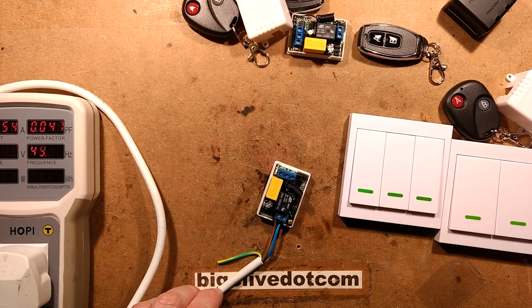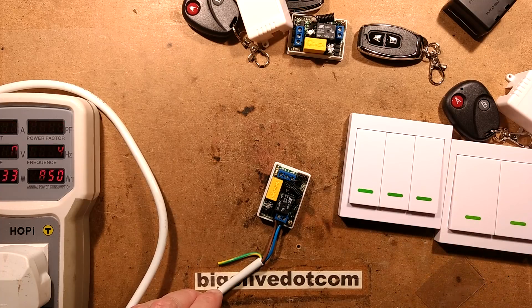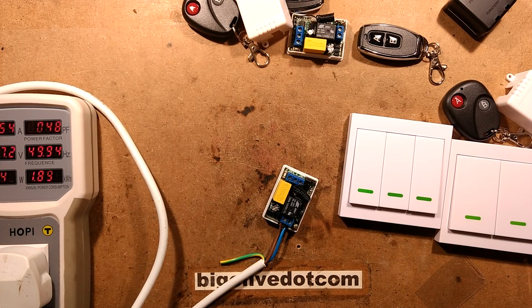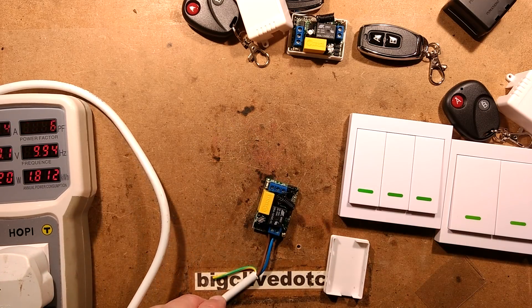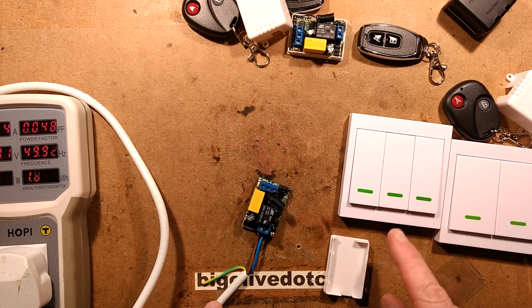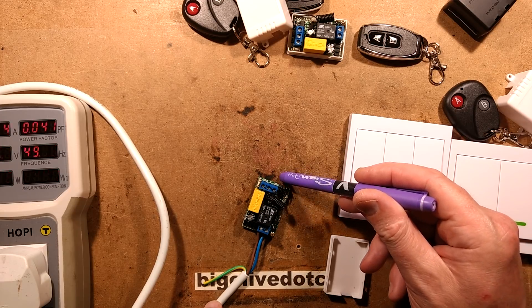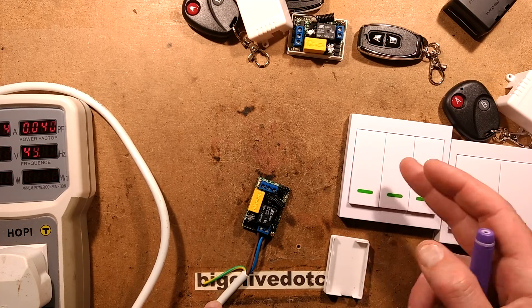Programming this - right, this is where it gets a bit precarious. Use a plastic pen and press the button. Use something thin and non-metallic. I'm just going to pop this out and sit it on the bench - that's better. Now I can press it. When you press it the LED lights, hit the middle switch and the LED pulsed and then went out. That toggles it on and off. You've got a little link here - if the link's put in the other position it'll just be momentary action: as long as it's held it'll stay on, and as soon as it's released it goes off.